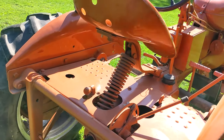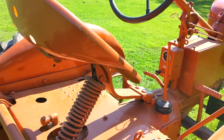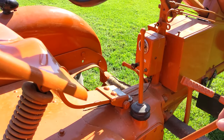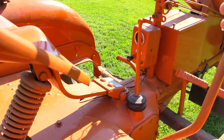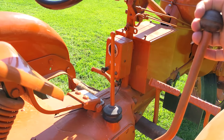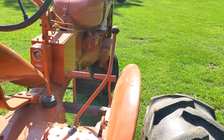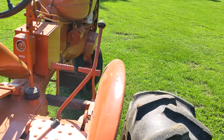There is no live PTO on this with the clutch in. Allis-Chalmers' way to have a live PTO was through a hand clutch. This is a dry type clutch that interrupts the drive to the outer axle. You simply pull back and that disengages the clutch — the tractor will stop and the PTO will continue running. It wasn't the best system; the dry clutch would get hot pretty quick. The wet series of clutches that the WD series had was much better.